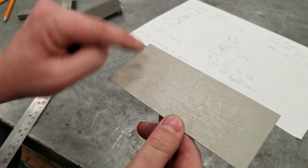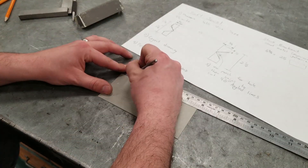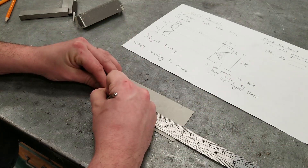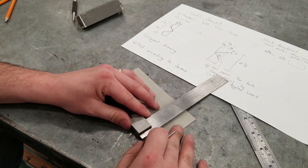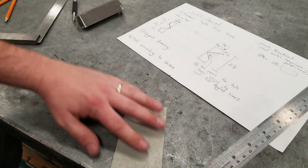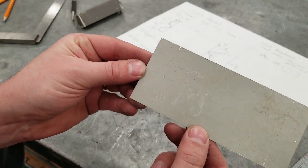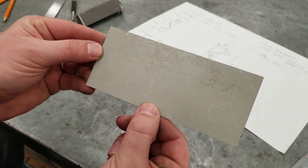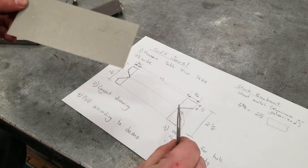This is my center line — that's where I will have one bend. You can see my line down the middle there. Now let's add the tabs; they're going to be three quarters of an inch wide. Same thing at the bottom. This is where you could also be using the machine square, lining it up that way. Use the tools that you have available. You can start to see that taking shape — I have a center line and now I have lines for my tab, and we're going to add our angles now.